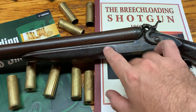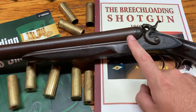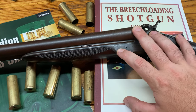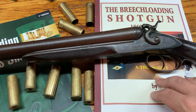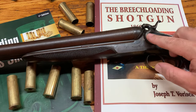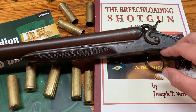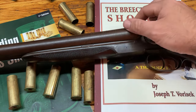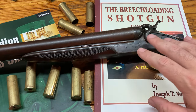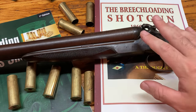For those first few years, they made guns like this — these are side swings. This is a side swing 12-gauge. I'll explain and show what that means in a moment. But these guns were part of a transitional period from the 1870s to 1890s where there was a lot going on with side-by-side shotguns. You have hammers going internal, thumb openers, trigger openers, the Ethan Allen trapdoor style actions working on shotguns, this side swing — shotgun makers trying to figure out what works best and what the public wants most.